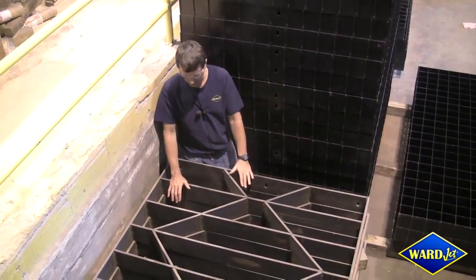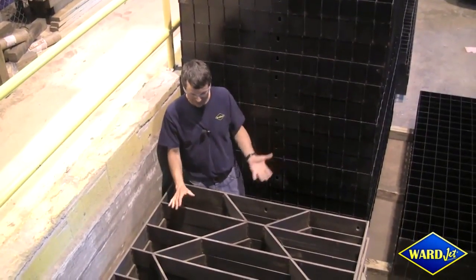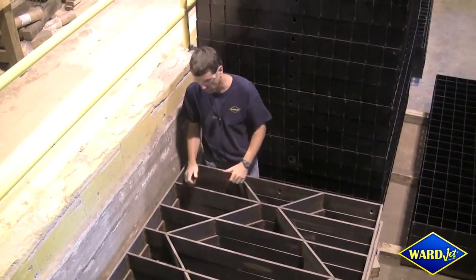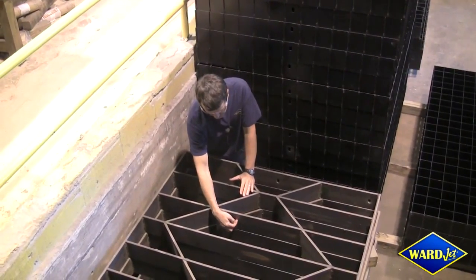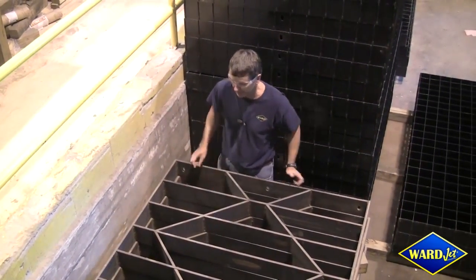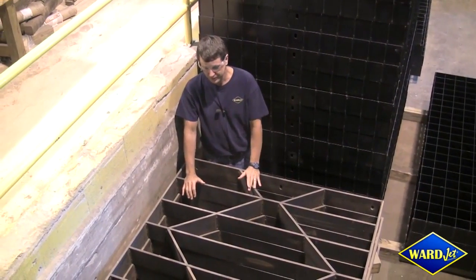Here we have the heavy duty grates, all out of 1/2" steel, same size as their sisters on the job shop grate, but the intention is to have open spaces so we are not cutting through lots of supports, strength of course. And if in the event you do cut through a section of this, you can either just put another plate on there and weld it up, or you can even come and weld that gap up. So these grates effectively should last you as long as you keep repairing them.